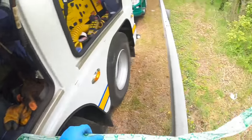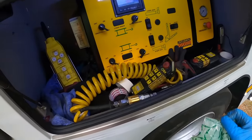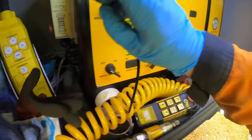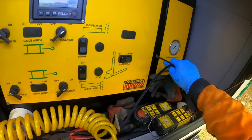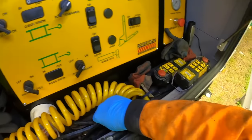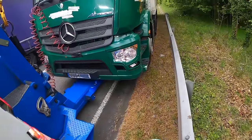These Mercedes, I haven't got a half shaft cover for this. They do tend to leak out actually, because they're roller bearings. The only manufacturer we pick up that has roller bearings. Normally you put a plate over them or seal the middle. It stops any leaks, but on the Mercs we don't, unfortunately.